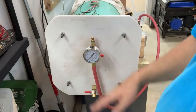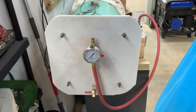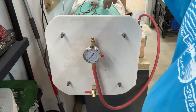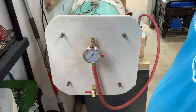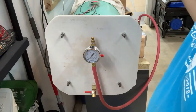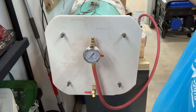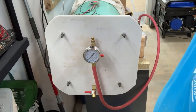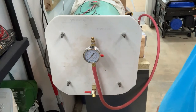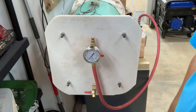The problem is you want it to conduct all the way through the wood — if you get it real hot on one side and that part dries faster, you can get cracking. So since they're so thin I can leave them on 50. They might have dried even without the heater honestly. This has multiple fail-safes: there's a thermostat to keep it from ever getting too hot, a 12-volt power supply that'll shut off with runaway current, and thermocouples on the metal that'll shut it off if it ever gets super hot. So I feel pretty comfortable leaving it down here — it'll stay this way for days. I'll come back and check tomorrow, or maybe even an hour or two from now, to see if that gauge has moved. If it's not where it is right now, then I have a leak. Till that wood's dry there's nothing else I can do, so I will bid you adieu.